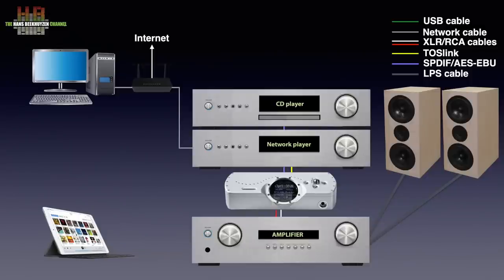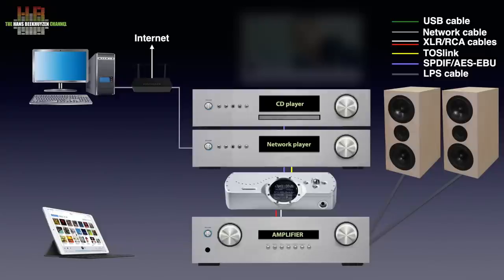Depending on the player, it is connected over S/PDIF, Toslink or AES-EBU. If you own a Chord Blue CD player, this is connected over a pair of BNC cables. Since the DAVE has numerous inputs, all kinds of other digital sources can be connected too, provided they output either S/PDIF or Toslink digital signals. You can for instance connect the optical sound output on your TV to the DAVE to play the TV sound over your stereo at very high quality.